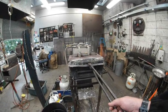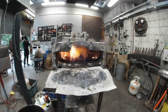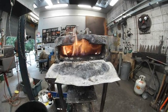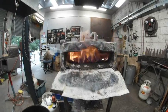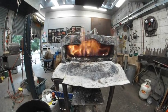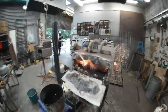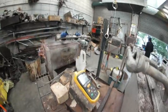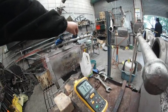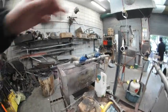I'm on to the next step of the process. I'm trying to bring the steel up to a temperature so I can pop it in the oil bath for hardening. I'm also trying to regulate the temperature — it does look a little cold at the moment — and I'm changing the amount of air getting into the forge to bring it back up to temp.